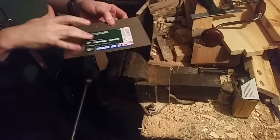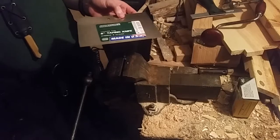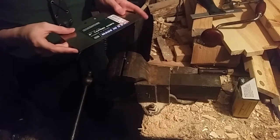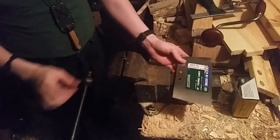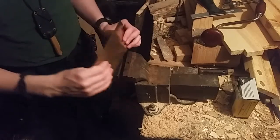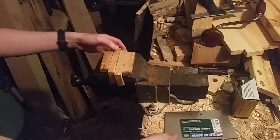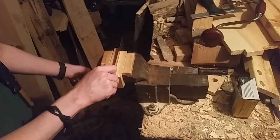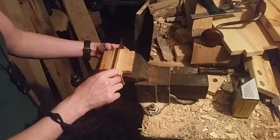Now, I could scrape this paper off, but I think the easiest way to do that would be either to hit it with a heat gun or to use some solvent, probably alcohol. So, isopropyl. But that's not really necessary for our purposes here, because I'm gonna go ahead and call that surface sufficiently polished. So now what I'm going to do instead, I'm gonna set my soft jaws in. Get that so that it's just peeking out.